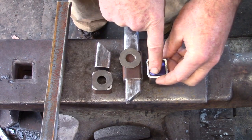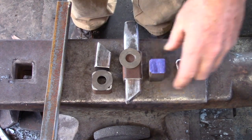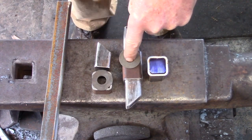You can see with the square tubing — with these round corners — that I have to remove the corners off my inch square, and then like I said I've got to remove that little bit of the weld seam there, enabling this to move up and down freely.